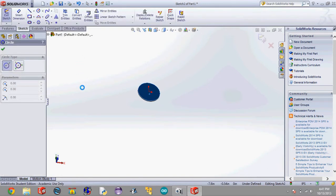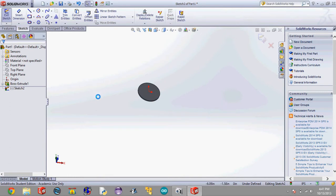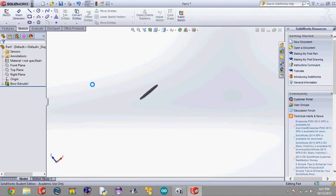In this My First Rocket project, the kind of motor we're using is an F39, and the diameter of that motor is about 1 inch. So we're going to make the diameter of this hole actually a little bit less than 1 inch, because the diameter of the motor isn't exactly 1 inch. Now that we have this boss extrude, we need to create another sketch. The way you do that is you either click on one of these faces or one of these planes — I'm going to click on this face because this is the face I want to sketch on.